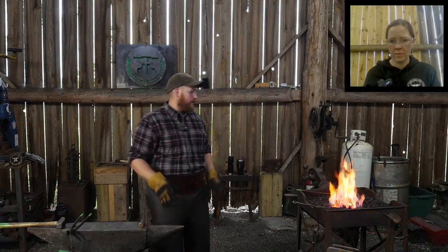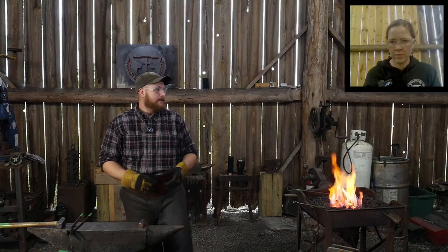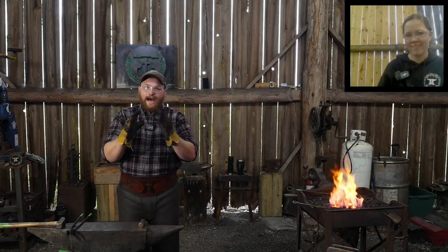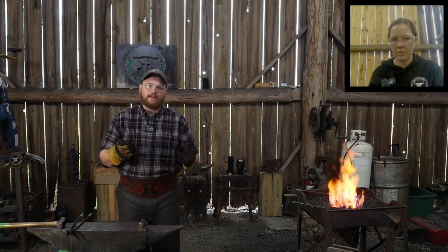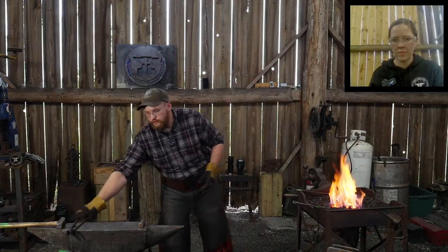That's going to get all drawn out into the bit of the axe, the blade and the bit of the axe. It's all going to get drawn out from that roughly 2 inch by 2 inch, or 1.5 inch by 1.5 inch, if you will, by 5/8 inch thick piece. So there's a lot more mass there than you think. If you look at most axes, they're fairly thin around the eyes of the axe, and a little thicker at the pole, and then they've got a nice long swooping taper to their blades, generally, depending on what type of axe we're talking about.